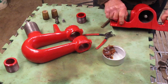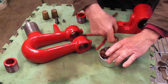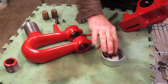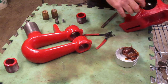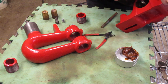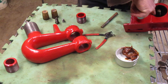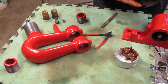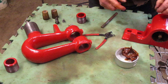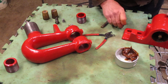That's all that does — it goes through there and into that part later. You've got to lube this part in here because that's where they all seem to lock up. I was thinking about using anti-seize but I just didn't feel like it. Now there's another part that goes in here — I can't get it down as far as I want but I think it'll be alright. There's a little brass thing in here. What that does is it goes in here so when you run the set screw in there, it doesn't gall that piece.